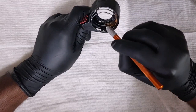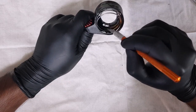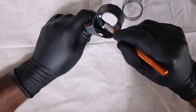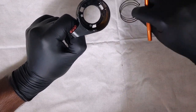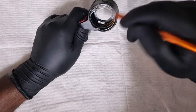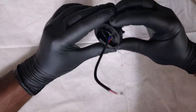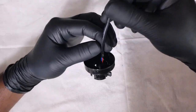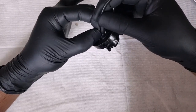When you take this out, ensure that these magnets are on this little square hole here, not stuck to this spring here — in the past I've seen them stuck on there. This spring is quite easy, there's a little hole here where the spring can sit into, so I can ensure those magnets are in their proper place. Let's begin by taking this sensor out and checking it. I can see that the cabling is not damaged, not kinked, and there's just a little bit of splice into the cable there but I don't think it's too deep.